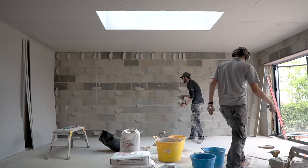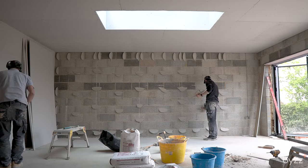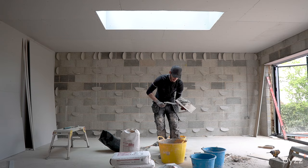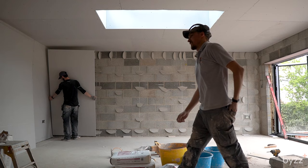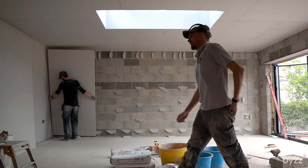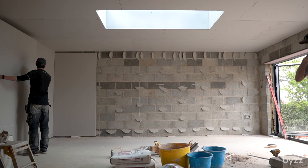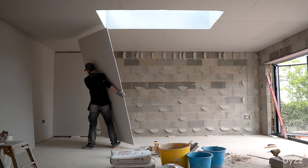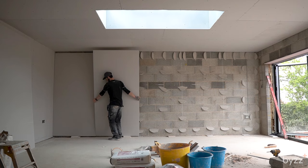Kyle is making sure he's got all the dots evenly spaced out at regular intervals. Now here is the first bit of sticking. Kyle is resting the board up to the left like we did before, offering it up to the wall, but he's not pressing it on - he's just basically touching the dots with it, not putting any pressure on, not spreading them out. He's just lightly touching them onto the dots just so it grips hold of them. Making sure we put them in the exact same positions they were in before when we first cut them.